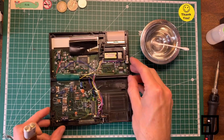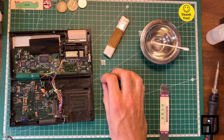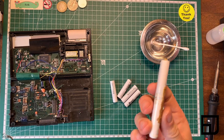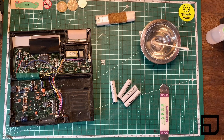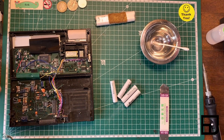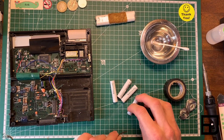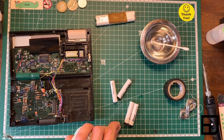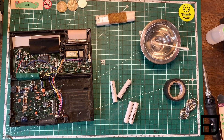While that soaks, I'll build a new battery pack. I'm going to use some nickel metal hydride — generic brand. This is presumably a nickel cadmium, but charging wires are generally the same, it doesn't matter. I'll fire up my iron. I've got some solder, tape, and wire. First I'm going to cut three lengths of wire just enough to bridge between the battery contacts and build a nice large series pack.